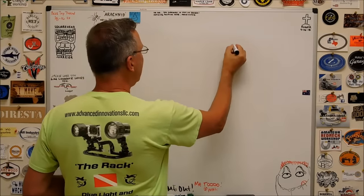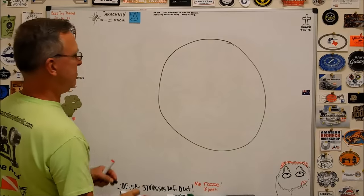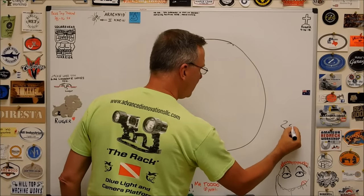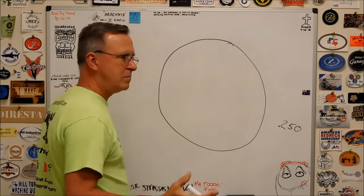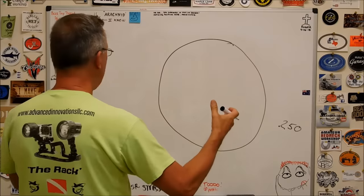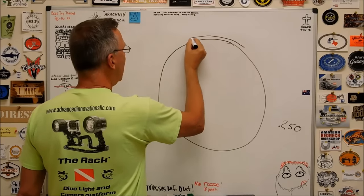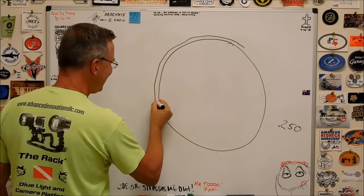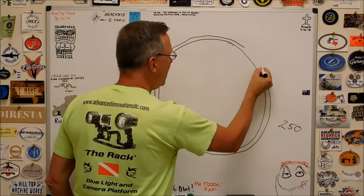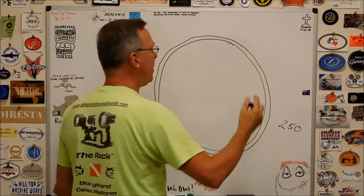Let's say we're using, I'll try to make this round and large enough so that you can see it. Now it's like a potato, right? 250 diameter. Six millimeter, 250 diameter. There's your drill. Your drill starts going in that hole, resulting in that is seriously ugly, huh? Well, we're gonna do it anyway, so hang in there. A 252 hole. Not unusual, right? A couple thou bigger.